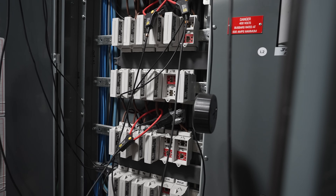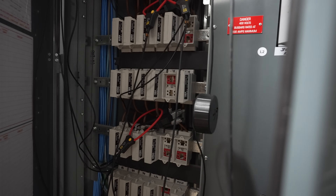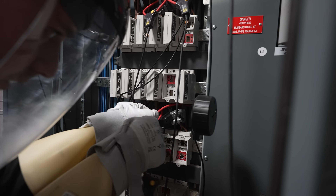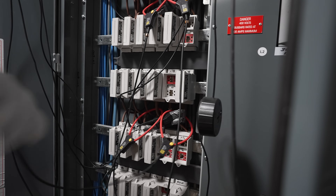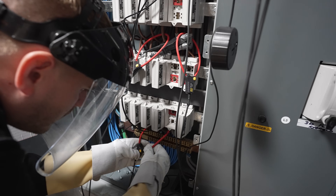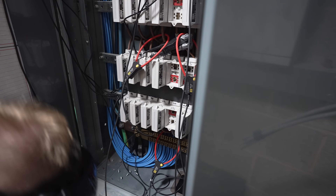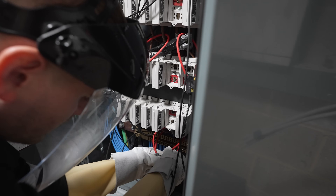There's another one — we'll get this plugged into our landlord's L2, lock it in, and then the next one is the L2 of the mechanical DB. There we go. The next one is the L3 of the mechanical DB, going in the correct direction. Finally the mechanical L3 — correct direction, locked in, lovely.